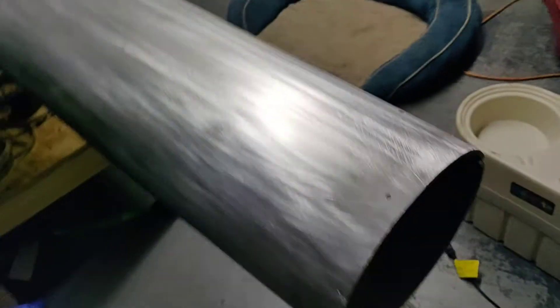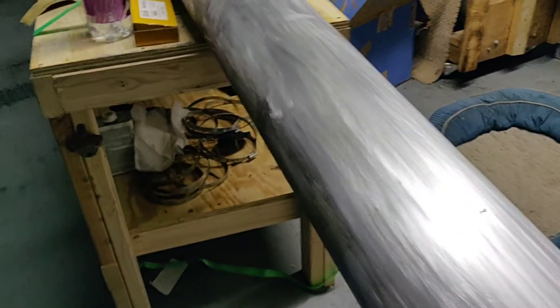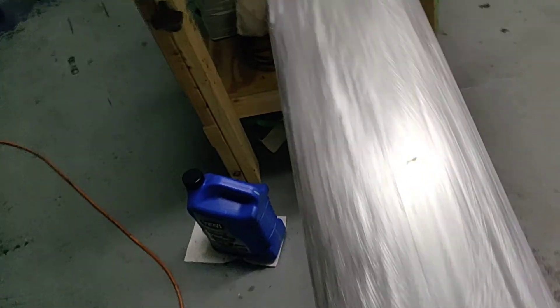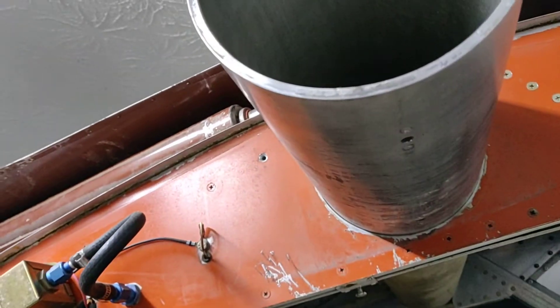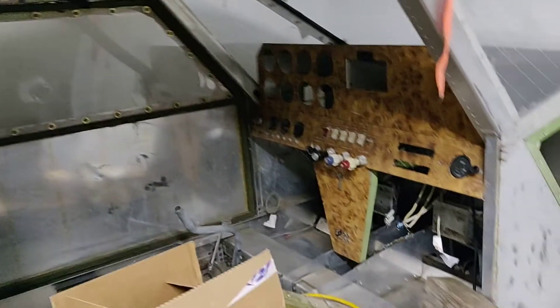I don't want to throw them away because really they're of no value — you can't use them as extensions, not if you stick with the 2024, because they're the same diameter. I can't slide one of these into the other; I would need a bigger piece for it to slide into. I don't know if I could simply reindex it. See these holes here? There's one on the outside, and this one bolt right here — that nut plate right there is held in by what looks like just regular Avex rivets, and they don't even look like structural rivets. That's the only thing that keeps this from squishing in and out, and that's where this guy goes.